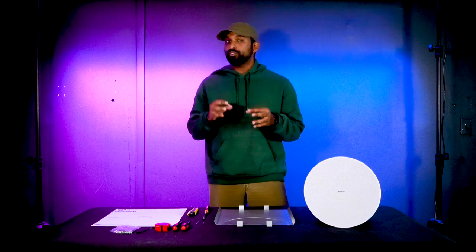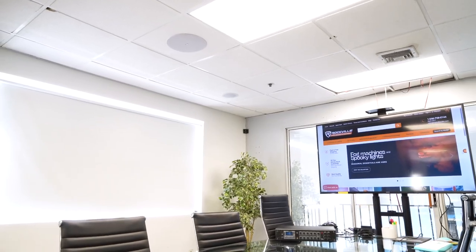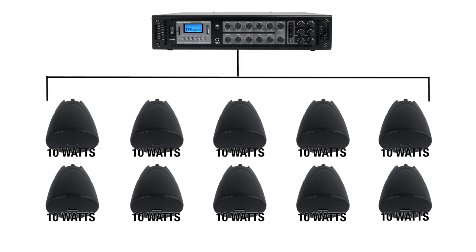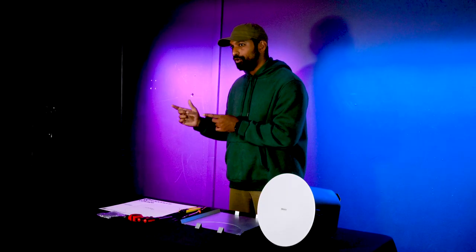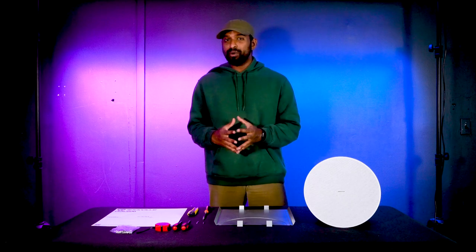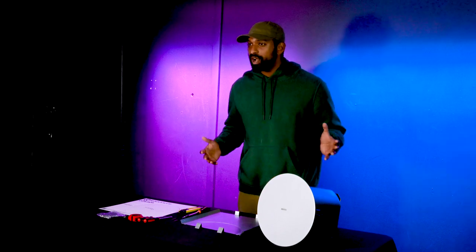Tapping is very important in 70-volt systems because you need to make sure your amplifier can produce more than enough power for all speakers in your chain. For example, 10 speakers tapped at 10 watts each equals 100 watts total. We always recommend pairing with an amplifier capable of producing more than required — so for 100 watts of speakers, use an amplifier rated for 110 watts or more. With a subwoofer, giving it more watts — like 50 — drives the speaker harder and gets you deeper, punchier bass.